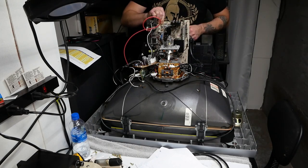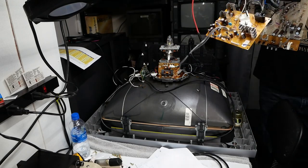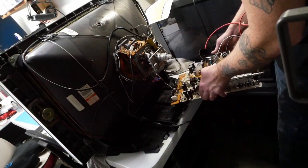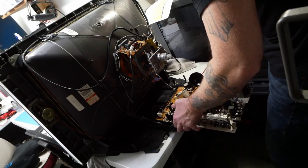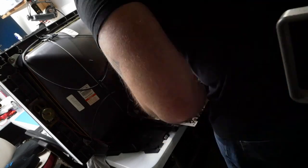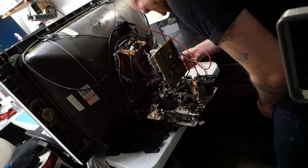Getting ready to drop this number seven pizza-pie combo back in the box — not quite. Those two power filter caps were way too tall and hitting the tube, so after much pondering I decided to flip the tube upright and slide it partially in, connect everything that way so at least I can get some testing and calibration done and see if I destroyed this set, fixed it, or guaranteed the longevity of a crappy geometry tube.